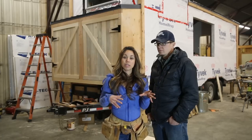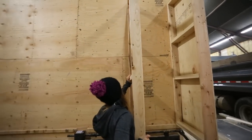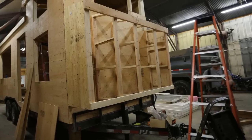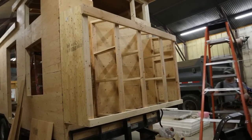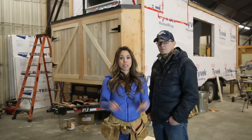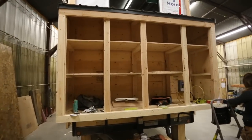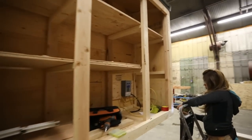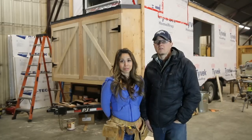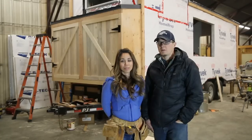Take your five frames and put a cleat up at the base of where the frames go, then set those frames up on the cleat and screw them directly into a stud in the wall. Then put your shelving in and apply the plywood to the ends. From there, add a two-by-six along the top to tie the frames in, and a two-by-four along the bottom. For the door area, add some vertical two-bys to separate out the door areas and give something to attach hinges to. On top of the shed, just plywood it and nail it down with some two-and-three-eighths ring shank nails, then it'll be ready for roofing.